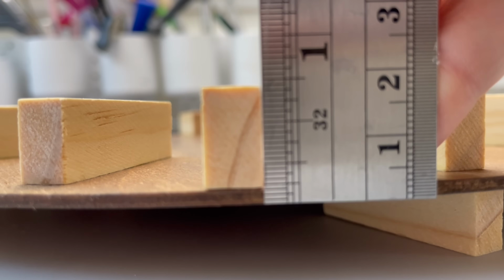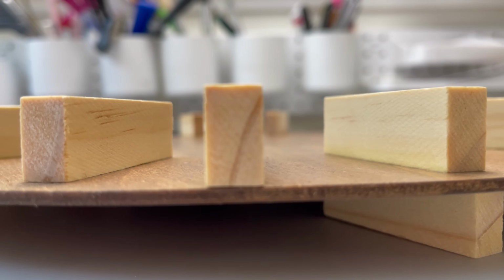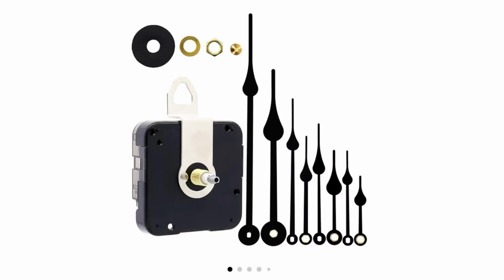Place the block on top of your wood round and measure the width of the block plus the thickness of your wood round to determine the shaft length you'll need for the clock mechanism that you buy. I'm pretty sure this one from Amazon will fit. I'll leave a link in the description, but please do your own measuring and don't just go by the link.